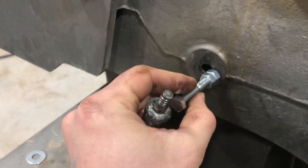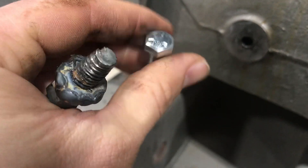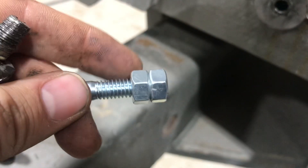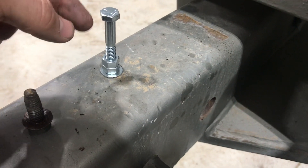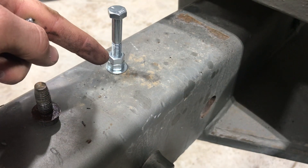You've got to think through it, because when you go to turn out that broken piece, this bolt would just unscrew itself from these jam nuts. So you may have to weld the jam nuts together, or the jam nuts to the bolt, so that you've got enough to hang onto with the wrench — because your welds will get in the way of your wrench grabbing onto these nuts.